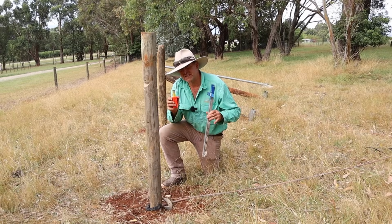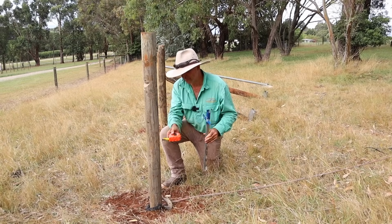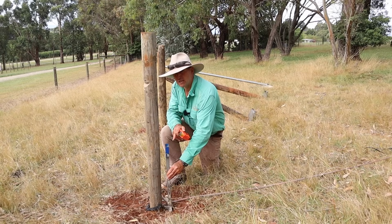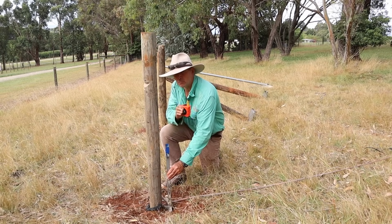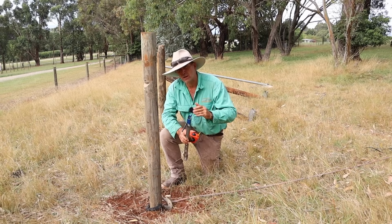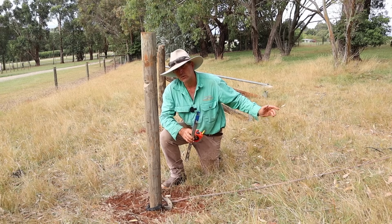Now we're going to turn stuffing around in a paddock into science with these. We're going to use a tape measure. We're going to come 50mm off the post, and we're going to bang in this telltale. When the post hits the telltale, we consider the post failed, because that much movement should have slackened off the fence. Now to pull on the posts, we're using a winch attached to each post about half a metre off the ground that is attached on the other end to a Hilux that's in gear with the handbrake on. Not that a handbrake on a Toyota does much.